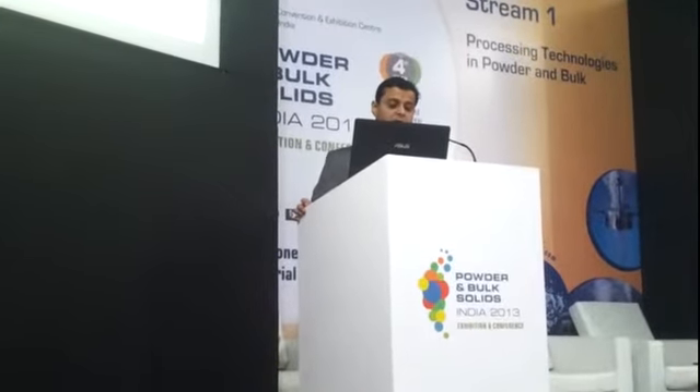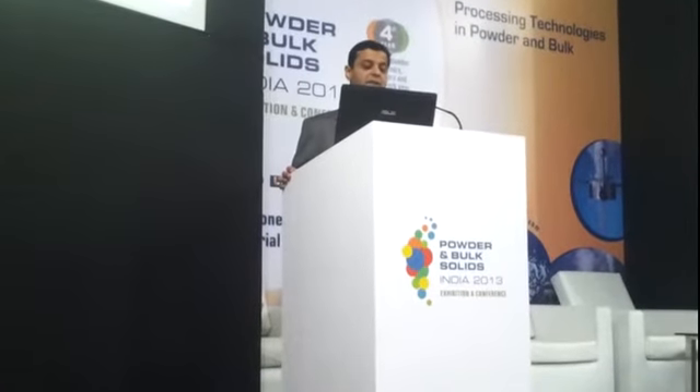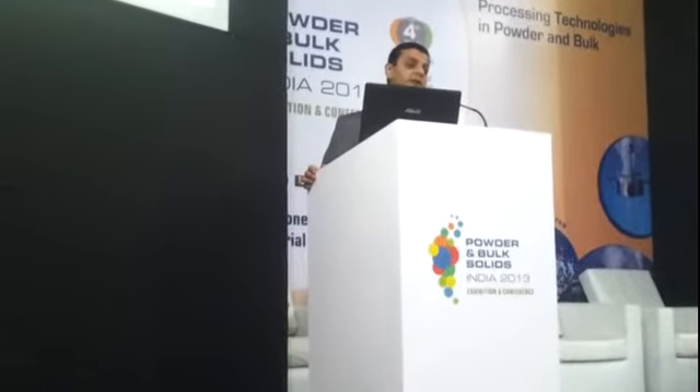The most important consideration comes to capital cost and operational cost. The V-blender and the paddle blenders tend to be less expensive compared to the vertical screw blender, the plow, or the double paddle. In terms of maintenance, all of them are fairly equal in proportion. The V-blender, because it does not have any mixing elements in the standard design, gives the lowest maintenance — although you can always have V-blenders with intensifier bars. In terms of energy, the V-blender, ribbon blender, and the vertical screw blender tend to take less energy per kilowatt per meter cube compared to the plow mixer or the double paddle. So if power is a constraint, the V-blender, ribbon blender, or the vertical screw blender are a better option.